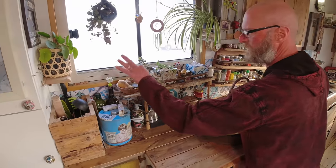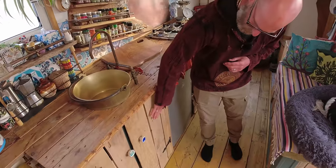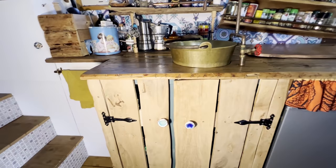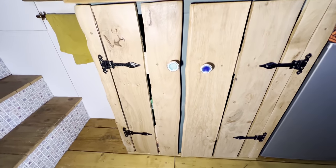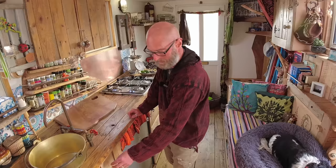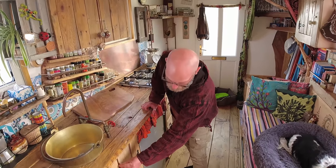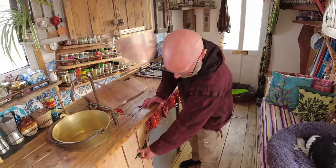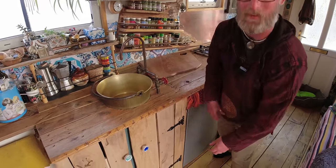Storage for cooking stuff. And then under here you've got these oak doors. We found them at an old wood yard — old oak panels — but they were really, really green. When I built these not many months ago, a month ago, these were all beautifully tight, absolutely lovely, and it's just dried out. So when we get back I'll just move that along, get an extra little strip, and just put them in to cover them all up.